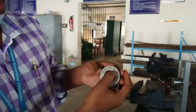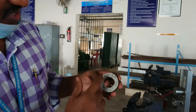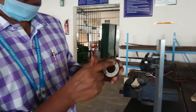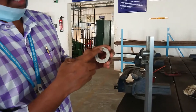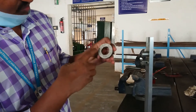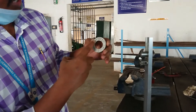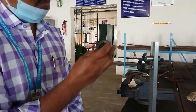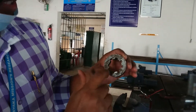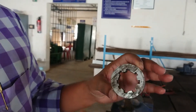Depending on the width and height of the keyway, you draw the lines. For a single keyway, one side is enough. If you want more than one keyway — like opposite sides — you draw another line. If you want four keyways, you draw on the horizontal line as well. More than one keyway is called splines. Eight keyways provided inside is called internal splines.